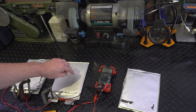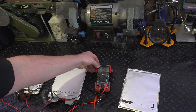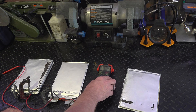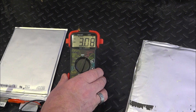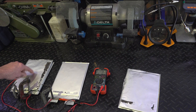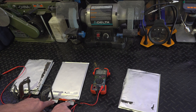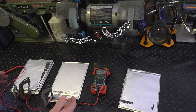Let's say this cell here is probably less than half a volt. I've kind of clamped it with some C-clamps here, and this is actually a good cell. These are in series. Let's go through this battery — you can see it's actually passing some current. Watch what happens when you load this thing down. You can see the thing almost drops to six millivolts and then takes a little bit to recover. What happens is when this thing fails and gets loaded, this battery actually acts as an open — it doesn't allow any current to pass from this series cell to that series cell.